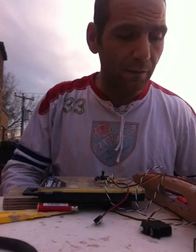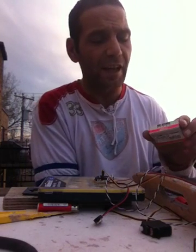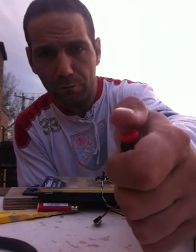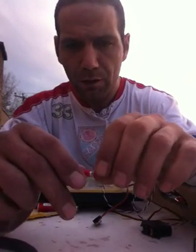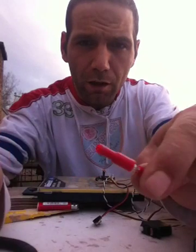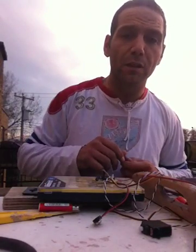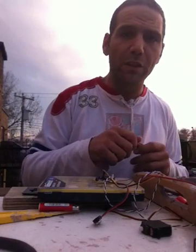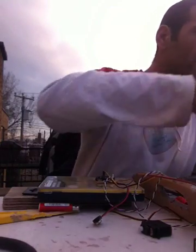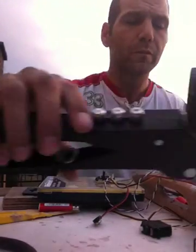You'll be needing some earth magnets, you'll be needing two micro servos - I suggest right away getting the HS-82. You'll also need push-button connectors for wiring your suit, just on/off switches. It's pretty basic - when your wires go down you won't have to take out a whole part just to reach it, you can just pop that connector out and put it onto your circuit board. You're also going to need some extra wiring. I got a rivet tool with some rivets for my system.